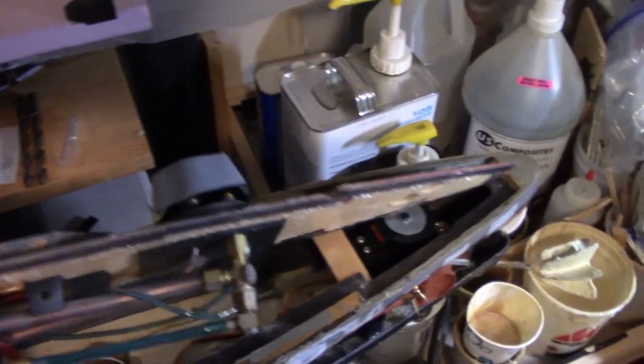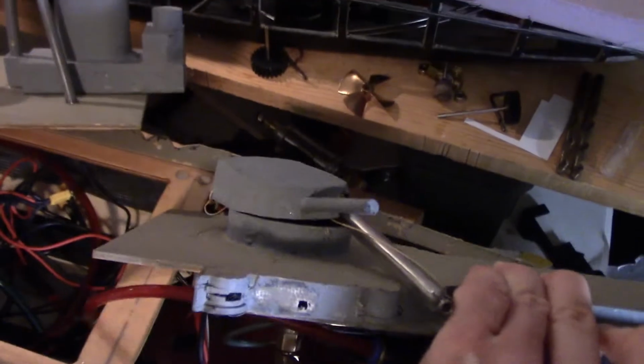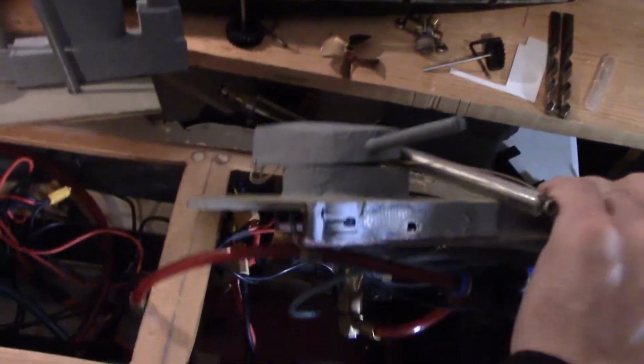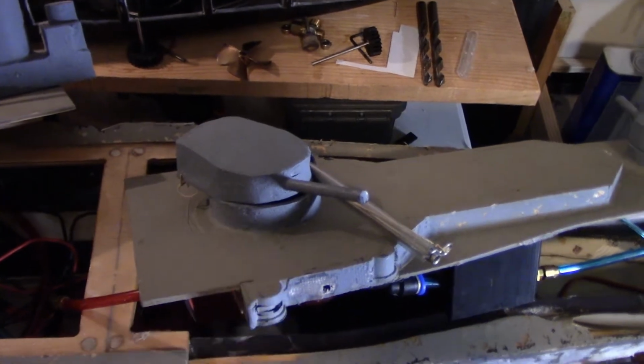You can also see the number of cross pieces on Congo. I have one right in the middle, and then one by the stern. The stern one helps support the deck with the guns and the solenoids on it. It's pretty typical for boats to have one pretty near the middle, and you just try to deconflict it with the motor location and any gun location. For Congo, I didn't put the cross member right at the step because it would have interfered with the turret, and that would have been an issue.